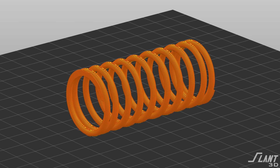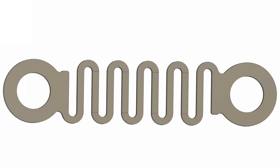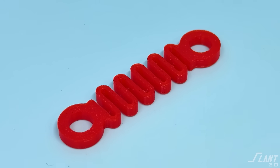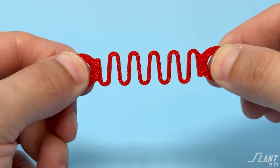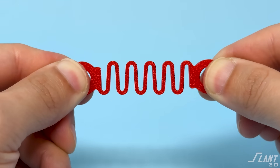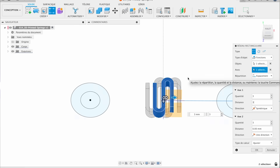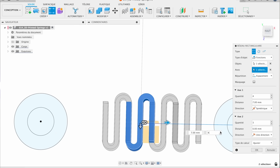If you want to create an extension spring — a standard coil spring function — what you do is instead of doing a spiral, you look at that spiral from the top and create that profile. Now you have a very simple flat-pack extension spring. These types of extension springs are really useful if you want some sort of resistance on a switch or a button, or if you need something that just gives really easily. All it is is a simple curved path going back and forth.